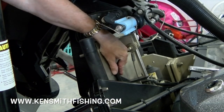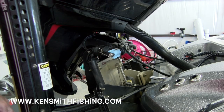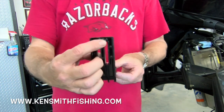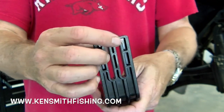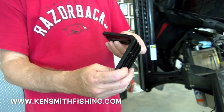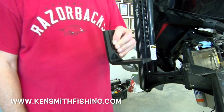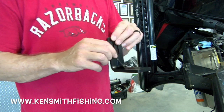When that piece breaks, it gets loose. Mine was barely dangling in there, and when it gets loose it can't read off the other end. The key to doing this — if you look at this part, it looks like it's interchangeable, but it's not. You see this end, there's nothing. On this end there are some tiny little dots right there. You need that part facing the boat, because there's a little piece of metal in here — this is read off a magnet. By that going up and down, it allows it to read. Mount the piece into the jack plate with that end toward the magnet to read it.